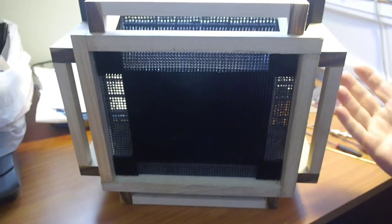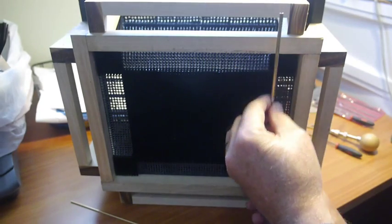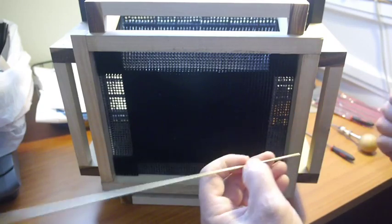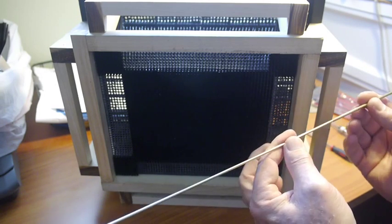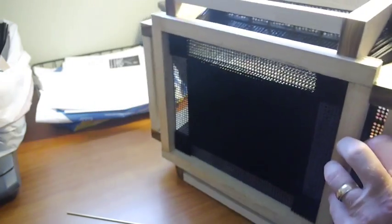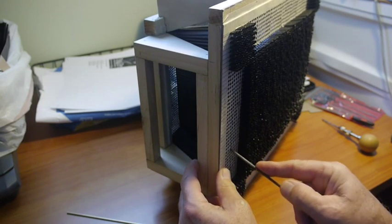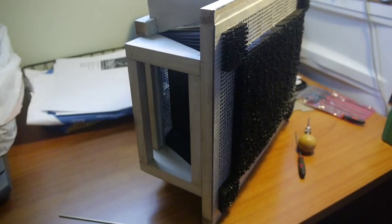That's basically how I'm doing this assembly — using a guide rod and a fixture with a depth gauge that I can slide along to get the back of the tubes all in the same plane. There's another brass tube that fits over the guide rod snugly, the same size as the stir sticks, which I can use to push the stir sticks back if they go out too far. A rat tail file that's an eighth of an inch size is also handy — sometimes the little wooden bracing pieces behind the cardboard mesh aren't perfectly lined up and you have to file them to make room for the tube to come through. That is how I put together the Light Pipe Array mesh.